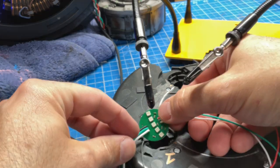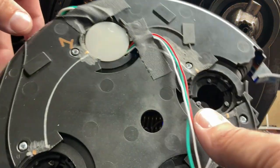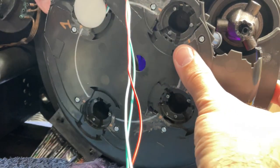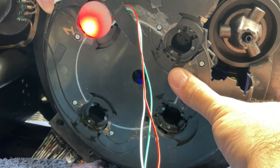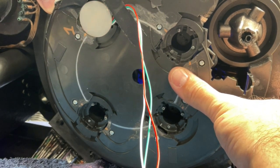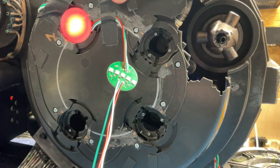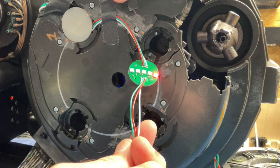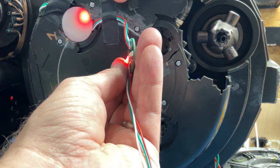Just get a nice little bead at the end of the soldering iron and just let it wick down in there. We just want to make sure nothing's touching — that solder should only be wicked into the socket where we put it. The first one's done! Oh yeah, this is going to look so much better. So we've got the second LED jewel wired, and it is working.